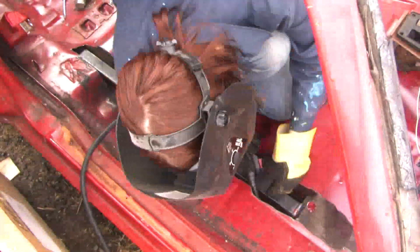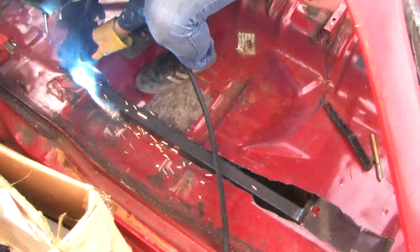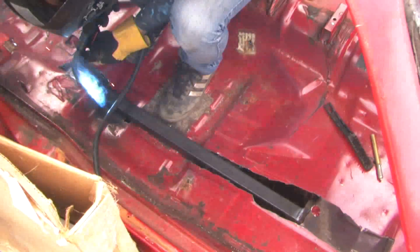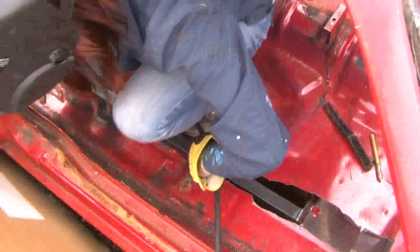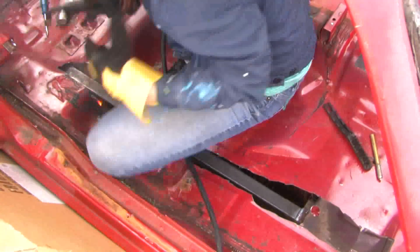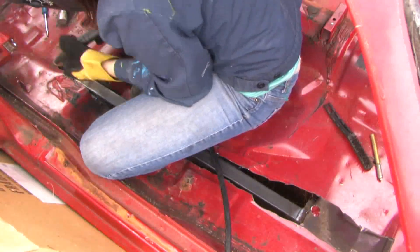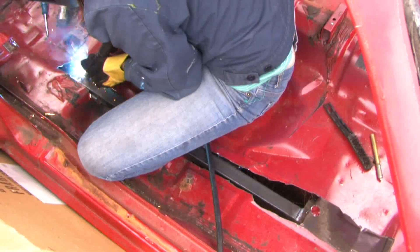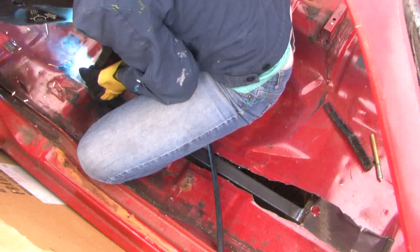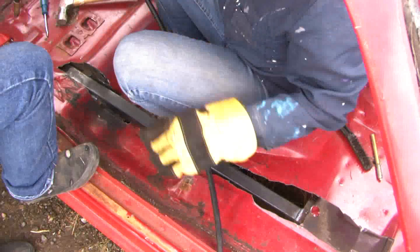To the left of this bar in the back, there's the leaf spring mount for the rear suspension, and this needs to be very rigid. I'll probably say this multiple times over this car build — you need to have a very rigid chassis to have a good driving car. I've heard people say you need to have your chassis flex, but that's absolutely the wrong way to go about it. Your springs should be doing the flexing, not your chassis.